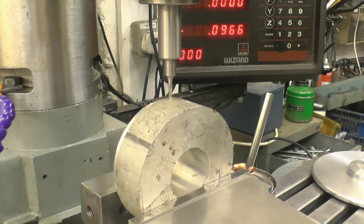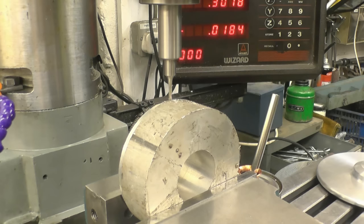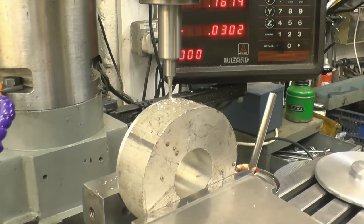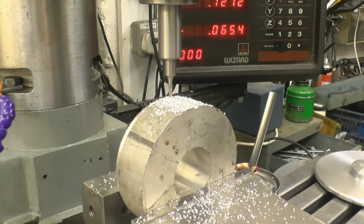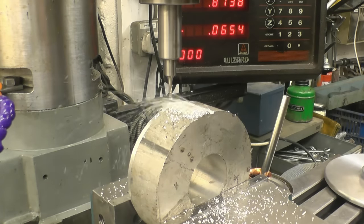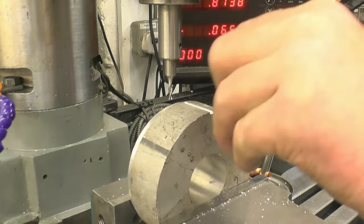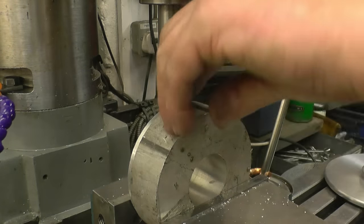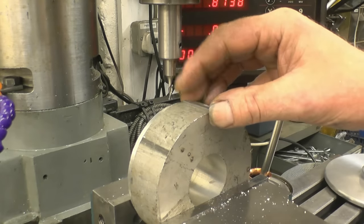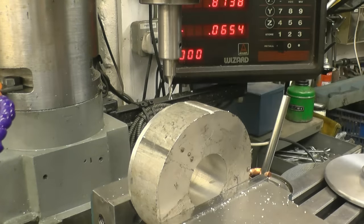Touch it off - it's just touching there. Zero the Z-axis on the mill, pull on 30 thousandths. As I said, this milling cutter has only got one ambition in life and that's to snap off. I think we'll try the key in there - try the keying in and see what sort of fit we've got. That's pretty good. That'll certainly do the job. I would like it a little bit tighter but there's nothing I can do about it. That's certainly not slack. Nice.